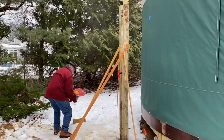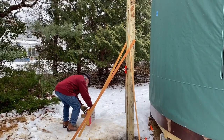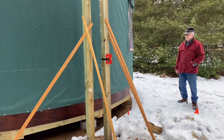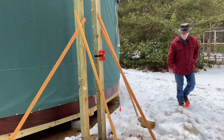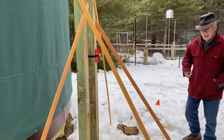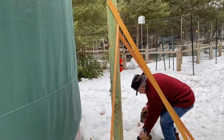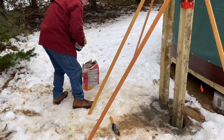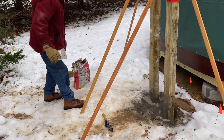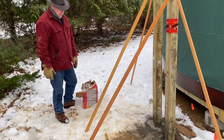The posts are temporarily balanced with these slabs from the lattice that we had left over. We have a level on — let me just walk around here and see the twin towers, he says. Yep, it looks good. So we pour the quick-crete dry right into the holes and then later we pour hot water on it.